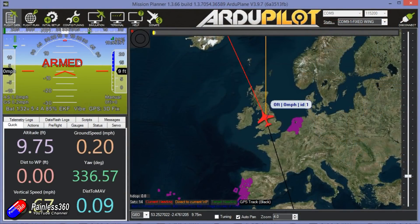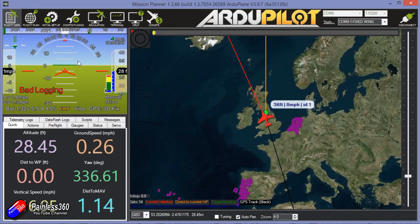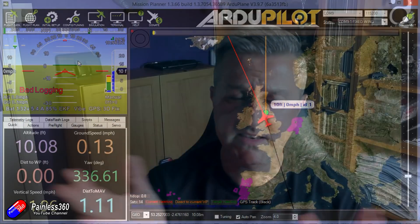The next problem was a bad logging error. The flight controller saves data onto the SD card when flying and those logs are useful if you have a problem later. I was initially using a 16 gig card and terrain data worked fine but logging didn't. I replaced it with a smaller 2 gig card, formatted it on a PC as FAT32, plugged it in, copied over the terrain data on the PC, then plugged it back in and fired it up - and that fixed it.